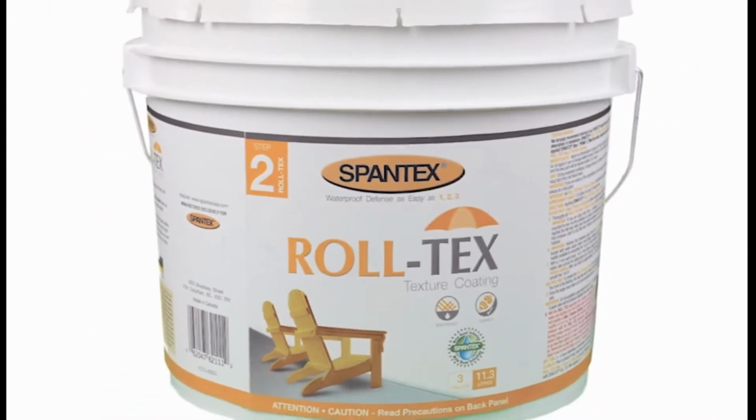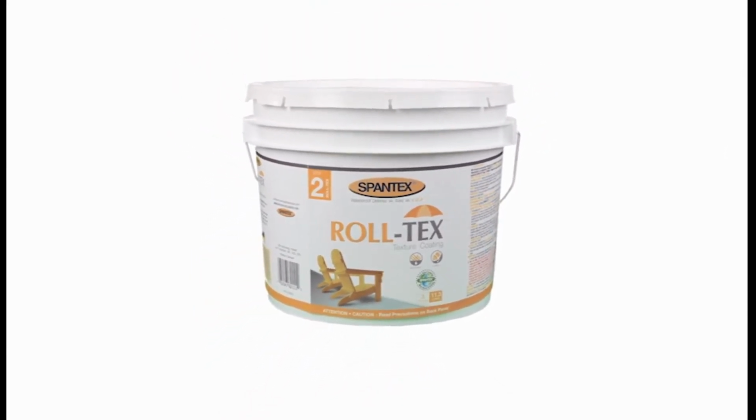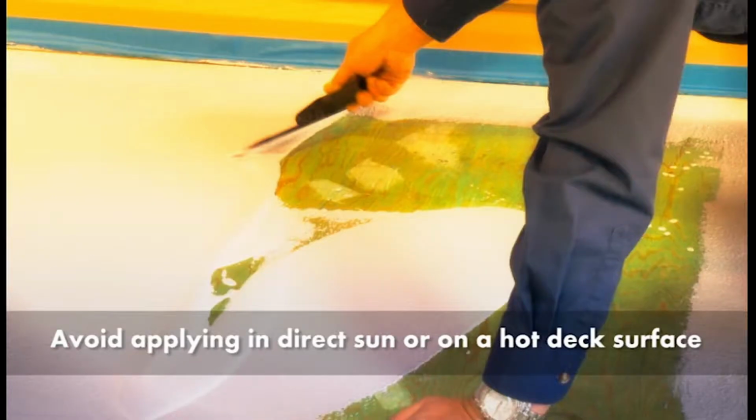Step 2, Roll-Tex, is a dense coating that is meant to be applied at a rate that is considerably thicker than regular paint. Roll-Tex is to be applied in 2 separate applications. For best results, avoid applying texture coat in the direct sun or on a hot deck surface. Applying in extreme heat causes the product to dry prematurely, which will considerably shorten the working time.